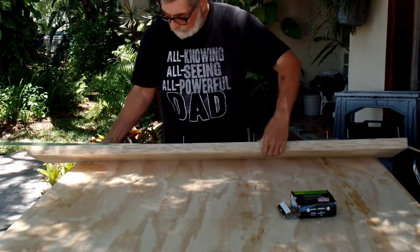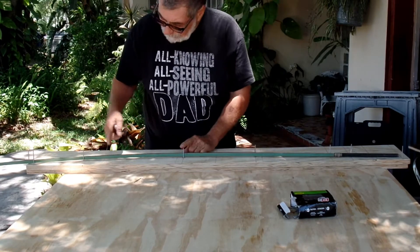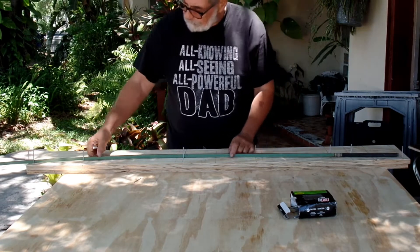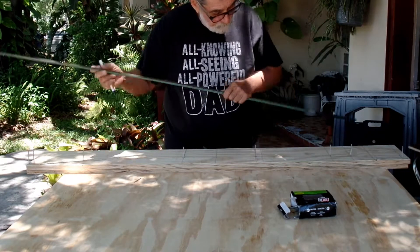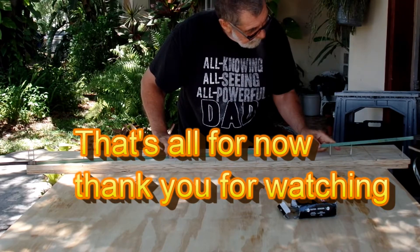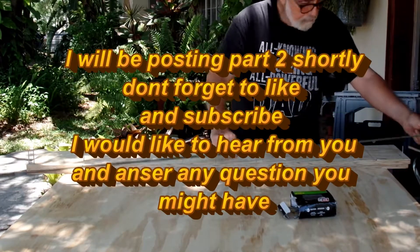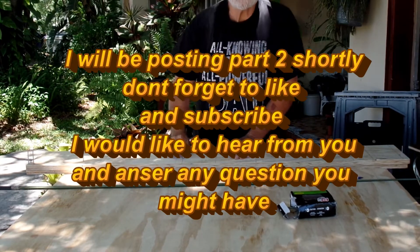Here's a rocker panel for the bottom. What I've done is I've marked out the specific points and measurements — my waypoints to give me my rocker. So when I use my trusty carbon fiber batten, I just scribe the line. Then I flip it over and do the same on the other side, lining these up. Then I pull the nails out, and then we're going to go and cut it with the saber saw.